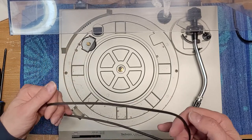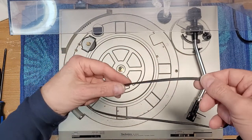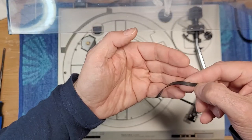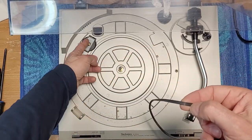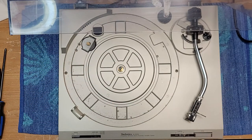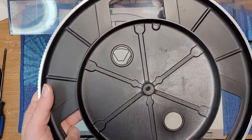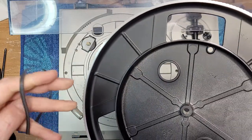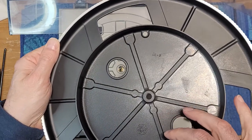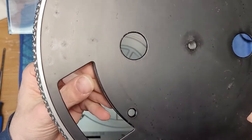If you don't want to go underneath and do any servicing — this belt still has a little bit of elasticity. You can see there's a little bit of wear on this side but the other side is still pretty dull, and this side's shiny — looks like brass from the pulley there. I like when the belt can hang on to this portion of the platter without falling off. This one fell off immediately, which means it's probably stretched a little bit. It's really loose.